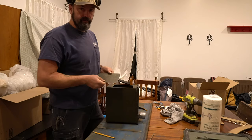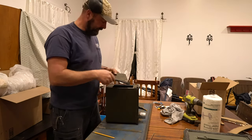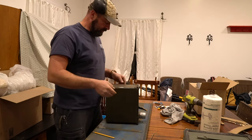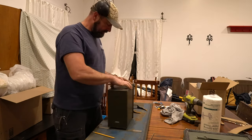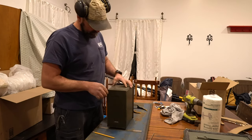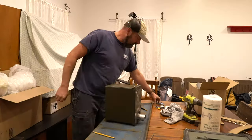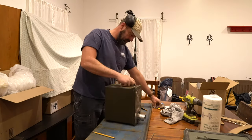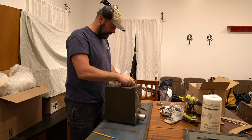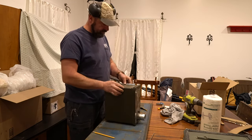So I didn't realize the battery ran out, and I got a pretty sturdy door that covers the hole by the top and the bottom. It covers the hole by a bit. Now I need latches and hinges. I'm just going to use regular 3-inch hinges, 2 of them. I'm going to put them in place, I'm going to weld them in place, and then the whole thing can close tight.